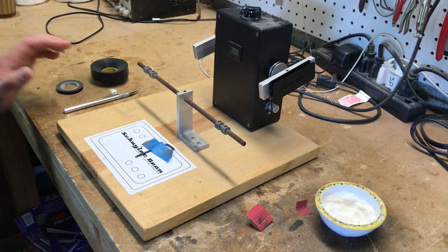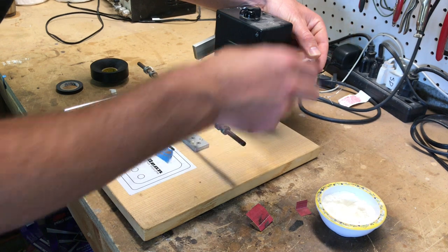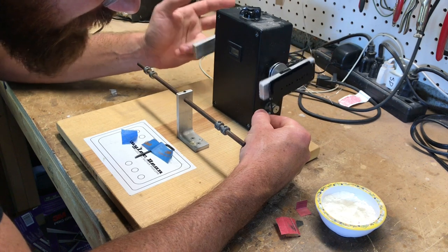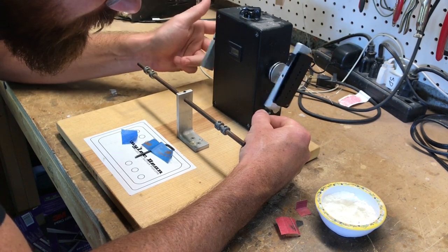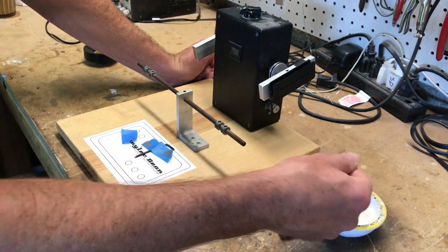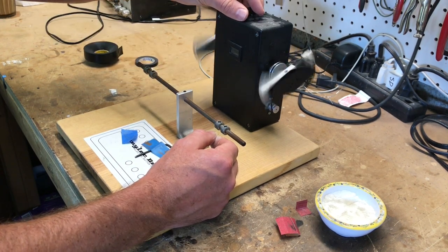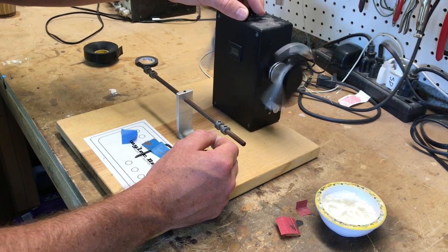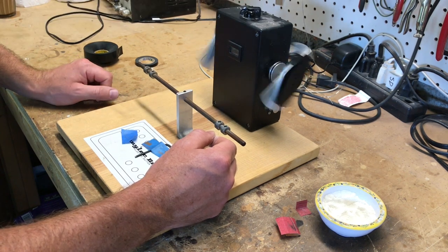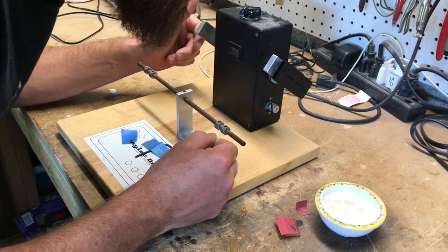My spool goes on the ground by my feet and I'm just going to tape this wire to the winder like I did with the humbucker coils, and I'll just guide this slowly on here for about 10 turns to get this wire started. I'm going to use some flour on my fingers to keep them from getting sweaty, and I'm just eyeballing the guides here. Last thing we did was a humbucker coil so this is actually pretty close — a few turns of that and we'll take a look. Looks pretty dead on.